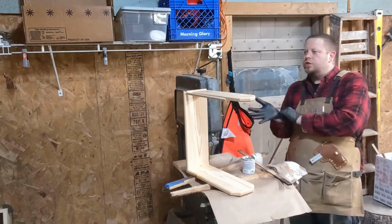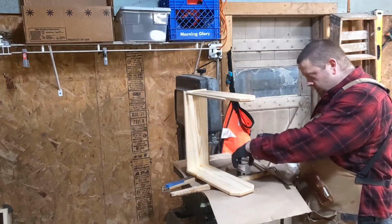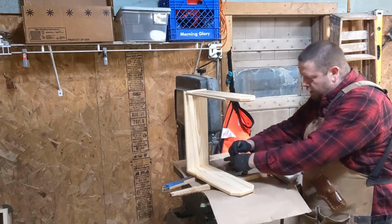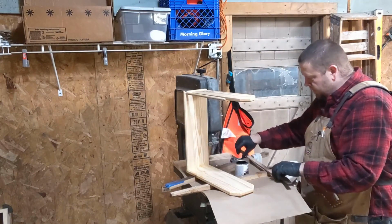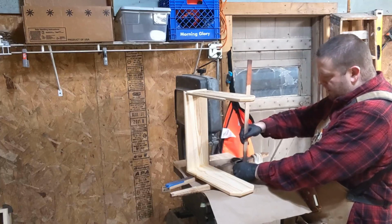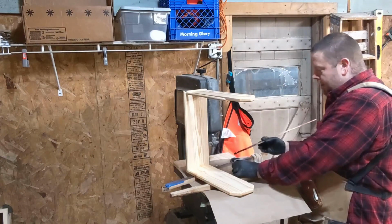Now that we let our conditioner sit on there for a half hour, we'll go ahead and get the stain on. Today, on this one, a stain I haven't used before, we're using the Varathane Ebony Wood Stain. I've been wanting kind of a darker look. The nice thing with these mask projects is I just keep picking up these little jars of stain one at a time, trying them out on these just to see how they look, and giving me some experience with different colors, different masks, even paints.